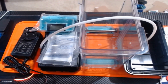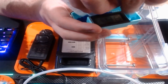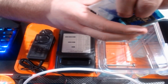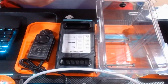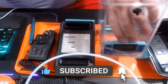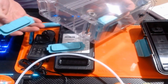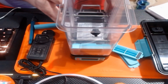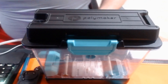In terms of assembly time, it took me about 10 to 15 minutes — there aren't too many steps. According to the instructions, the only assembly you have is to prepare the desiccant storage box by pouring the desiccant into it, removing the battery cover from the hygrometer, and then installing that component into the Poly Dryer Box. As you can see, my pouring skills need a little bit of work. From there, all you have left to do is remove the two airlocks from the bottom of the box, attach the box on top of the heating element in the correct position — you want the LCD of the hygrometer and the LCD of the heating element facing the same direction — then put your filament in, seal it back up with the top cover, plug it in, and power it up.